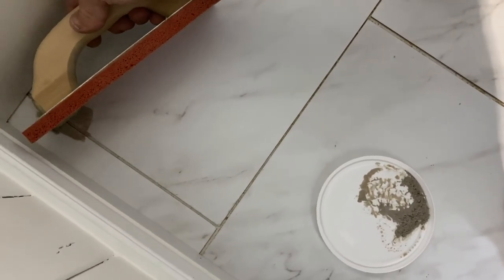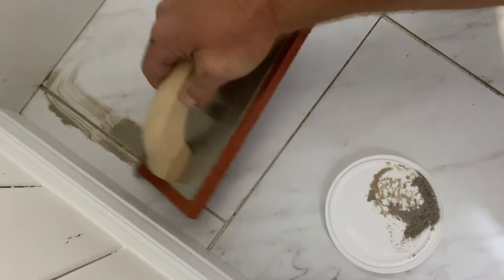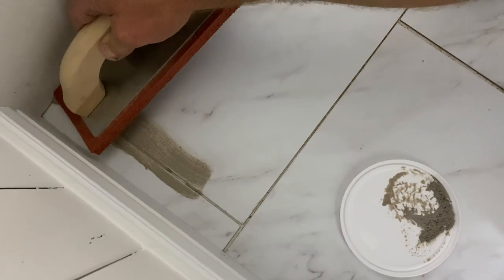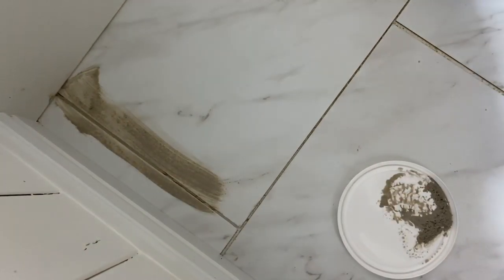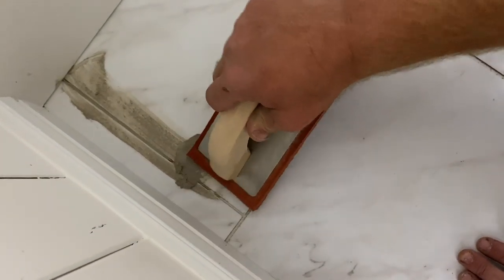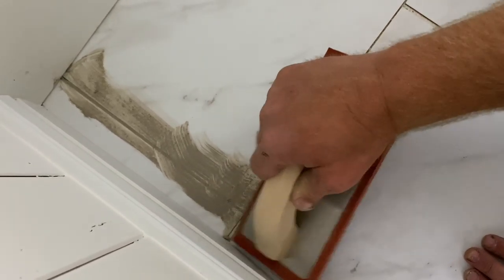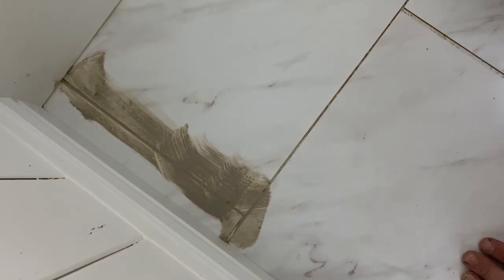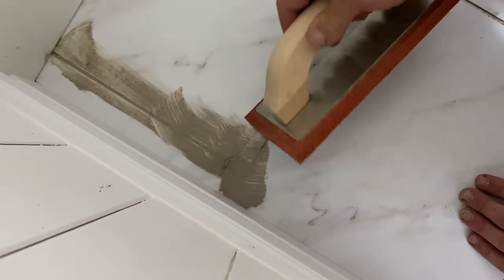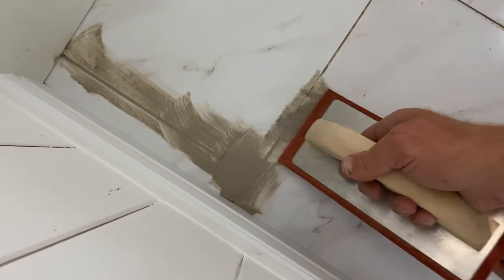Just look it up at Lowe's. You don't want to use a ton of grout and you want to keep it off the baseboards if possible. We're going with gray grout for a few reasons: one for contrast, and two because then I don't have to worry about having white grout. This resists stains and I don't think it needs to be sealed because it's vinyl. I'm gonna smear this on and then come back and wipe it off before I get too far because you don't want it drying on your vinyl.